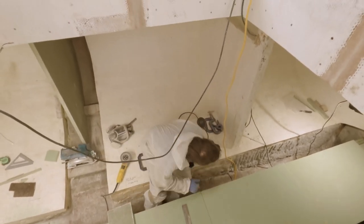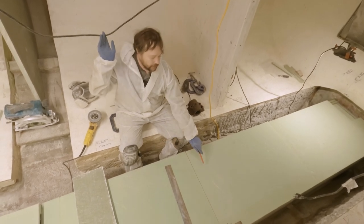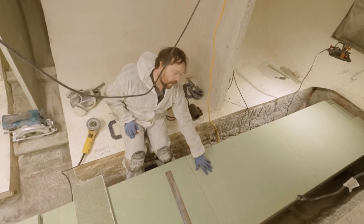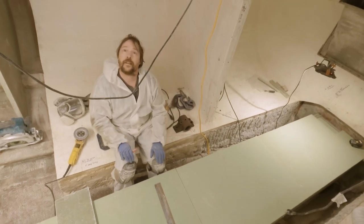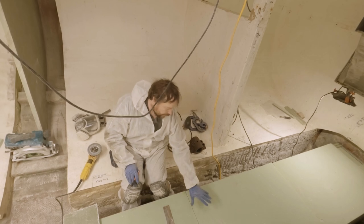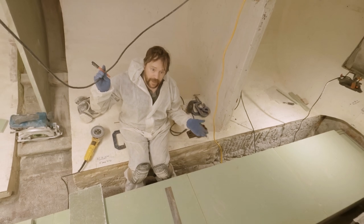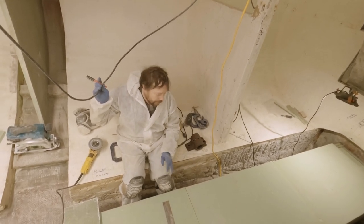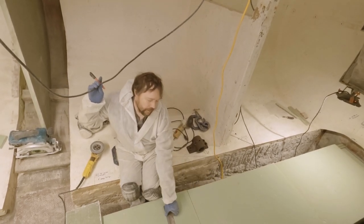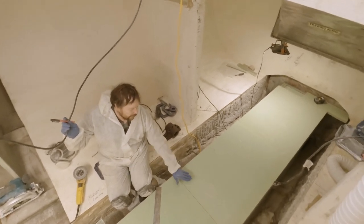We've had a lot of questions - a lot of people don't really understand what is going on here, so we'll just revisit that for new folks. This vessel was originally set up just to freeze on-board salmon in the round, and the shaft alley has never been sealed. In order to tank this vessel - that is, to fill these fish holds with water - this needs to be watertight, otherwise the water will just flow into the engine room and flood it. That's what we've been working towards: making these shaft alleys sealed so we can fill this with water, which means we can do RSW salmon - refrigerated seawater for salmon - or we can flood it if we're live-tanking crab. It also makes cleanup really easy when you don't have guts and blood going into the shaft alley.